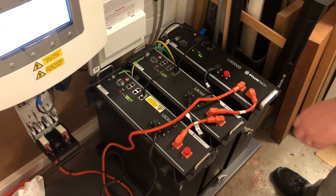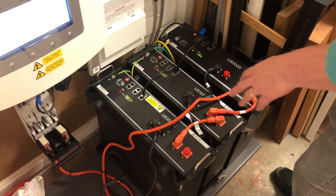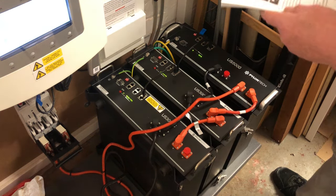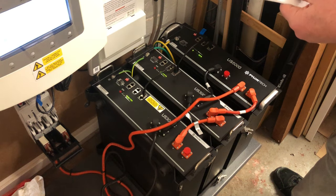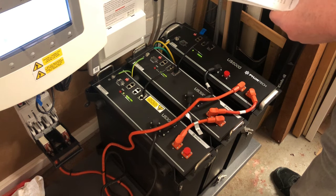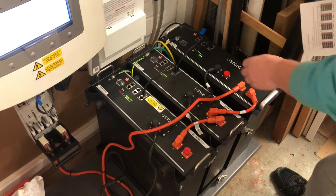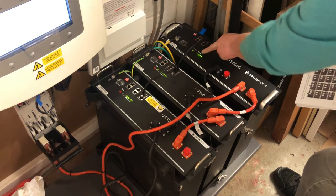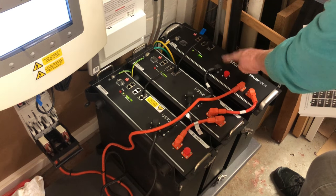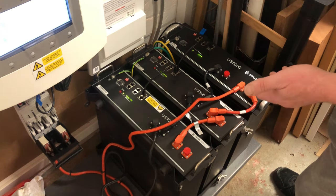I've had the batteries connected up in parallel for about 40 to 45 minutes and not connected to the inverter. Reading the manual — always a good idea — it says: during capacity expansion or replacement, when paralleling different states of charge voltage modules together, it is recommended to maintain the system in idle for greater than or equal to 15 minutes, or until the state of charge LEDs become similar, i.e. less than one dot difference, before normal operation. We're still two dots different, so the new module still needs to take up a reasonable amount of charge, but they've been in parallel for nearly 45 minutes so I think that's good enough.